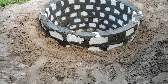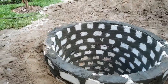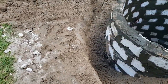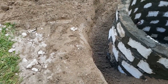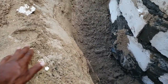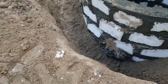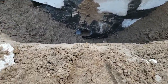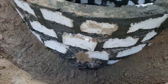Then we will make a cover. Before the cover, we have to make a chamber here for the pump — I'm going to have the pump underground so the top of it will be level with the ground. Inside the chamber there will be the pump, and the pipe from the pump will go through this opening here, down into the well. Then we make the cover.